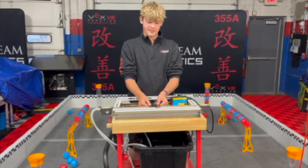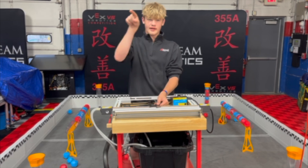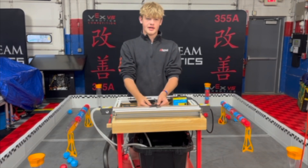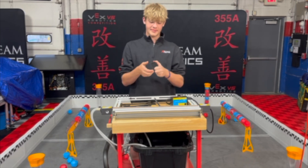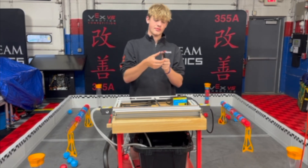I think it's also really important to have a nice 90 degree bend on your drivetrain caps, because if it's a really swoopy angle, you're going to end up ramping over other robots and maybe even game elements. That might be useful for the park zones, but I think the risk of ramping over other robots doesn't outweigh that.